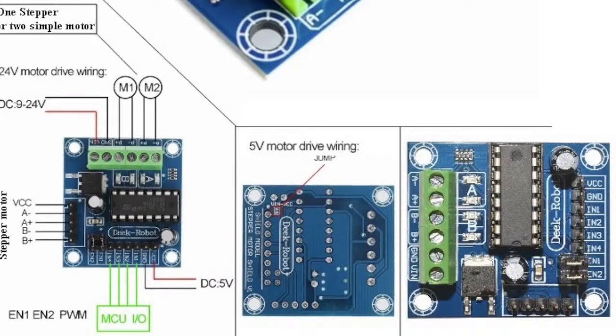So with this reversal of directions, you can control the direction of the motor. This is what you guys need. The only information you need to make it operational is how to change the polarity of pins, which you already know. It's based on clearing bit and setting bit. The second thing you need to understand is how to power things. Since this motor operates on 5 volt, you can provide 5 volt over here, and the motor will be operated. The only thing left now is the push button.